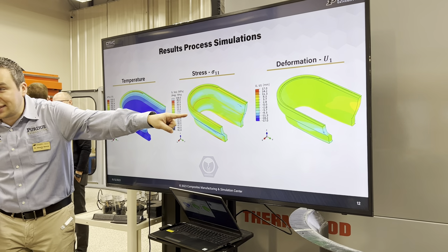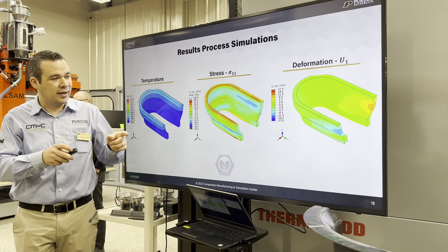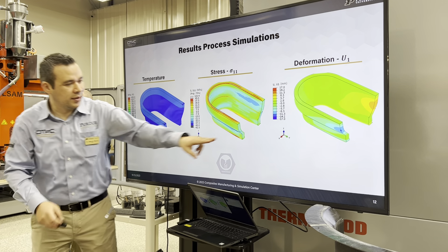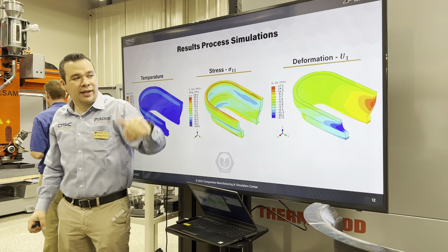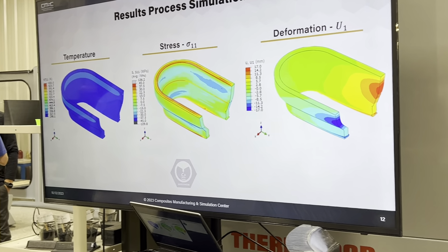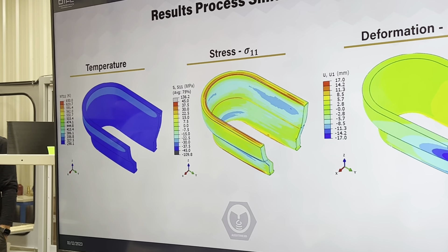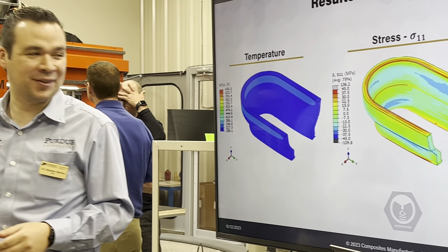What you can already see on the right hand side — we're looking at the deformation in the x-direction, so basically in these directions. The left hand and the right hand both deform in the negative x-direction. So this is around 70mm, which is well over the excessive material limits that we typically consider.